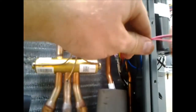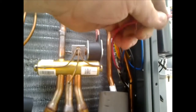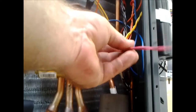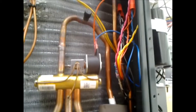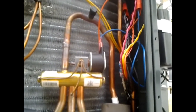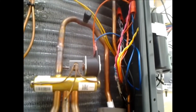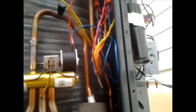Compressor. And there's 24 volt power, which really is only needed for sending power back whenever it goes to run. It switches the reversing valve over to put it in AC, and then sends a signal back on the heat wire, basically the defrost wire as I call it, to turn on the heat strips. Because whenever this thing goes to defrost in the winter, it turns on the AC inside. Basically runs cool air inside, so it has to have the heat strips to cancel it back out.